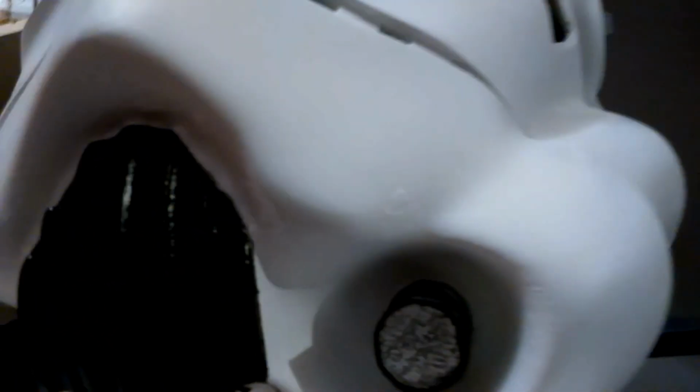The bigger parts that are way out in the open, you don't want to take acrylic, because you can see it slightly. I did this part right here on purpose just so you guys can see. It's slightly a different color. And if you do up and under here, once the gloss goes on, the final coat of gloss, you're not going to be able to see little tiny spots unless you really, really look for them. And so the bigger pieces that are out in the open, it's better to go in and sand it, get it down to like a smaller point.